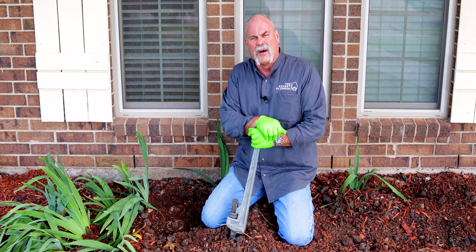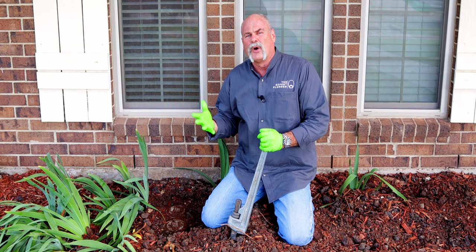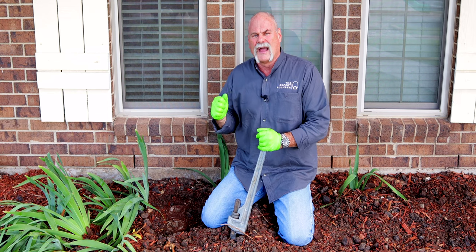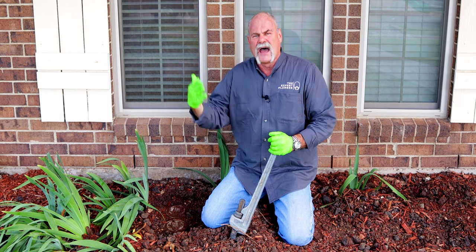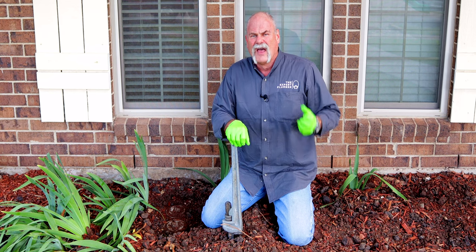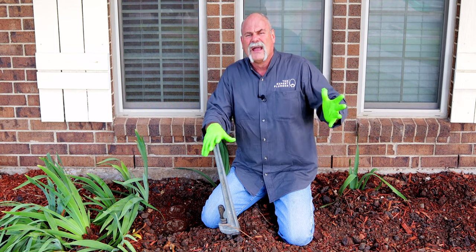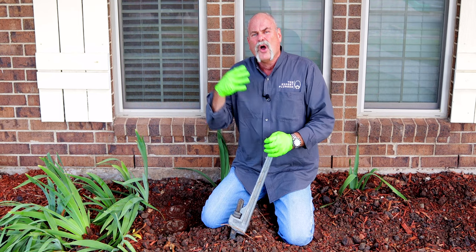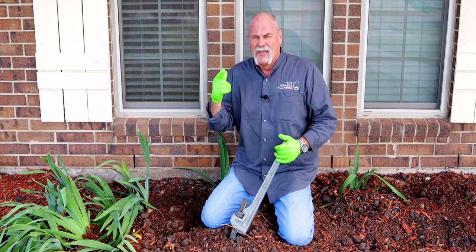If there's not a leak it's going to hold that water. We leave the test on for 20 minutes. We're also going to do a water leak test, because a sewer leak test and a water leak test are both things you need to do on a house before you buy it. Now, this is not a hydrostatic test — I know that's what's written in contracts in Texas, but a true hydrostatic test applies external pressure. We don't want to blow apart the plumbing system; we just want to test if there's a leak under the house.